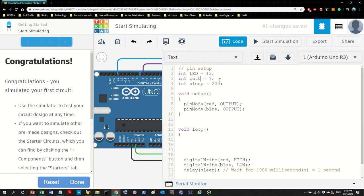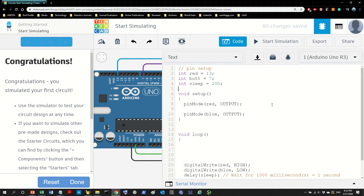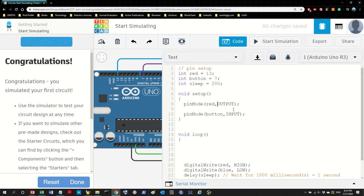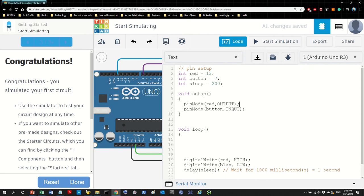If you don't like to write long names, you can call it LED like this. You can also just keep it 'red' since it's a red color, so we don't have to change the code down there. So now LED is an output — I agree because this is the light. But what about the button? Well, this is actually an input. We're going to call this input, because the button sends information to the board rather than receiving information from the board. So now we have set the button as an input.